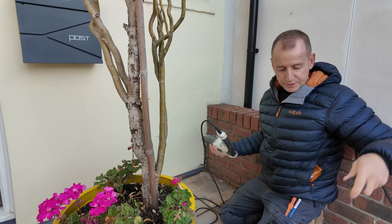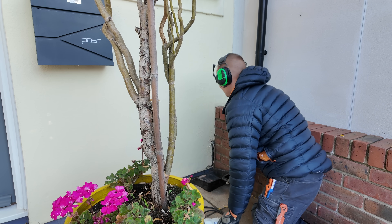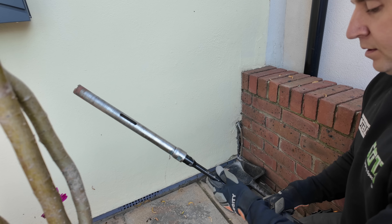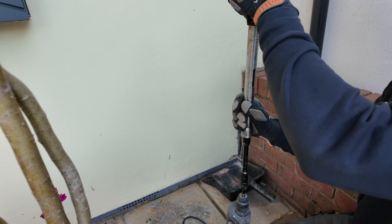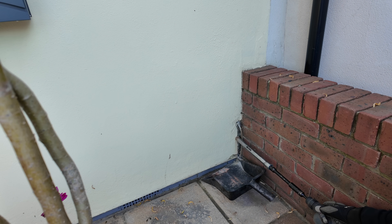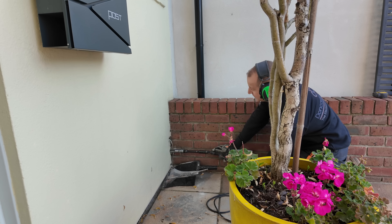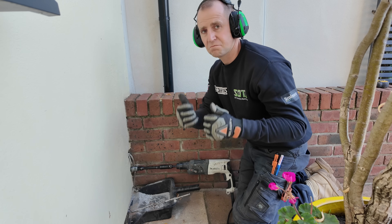There is a particular process I use to drill my holes through these walls. The first step is putting a 10mm SDS pilot bit through the first course only. Once I've done that, that gives me enough room to put my pilot bit for my 28mm core hole saw through — not on hammer — and then I can drill all the way through and get two clean holes both sides of the blockwork.